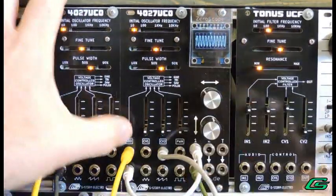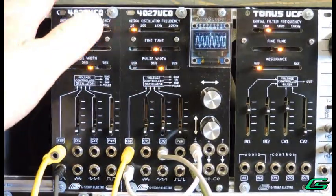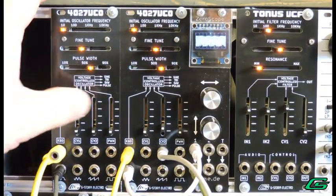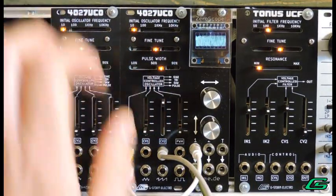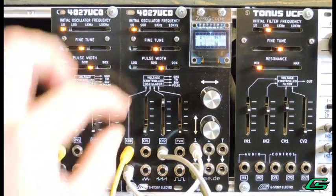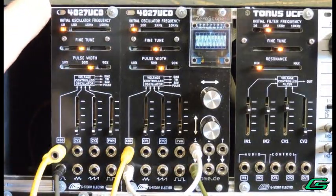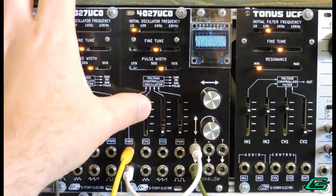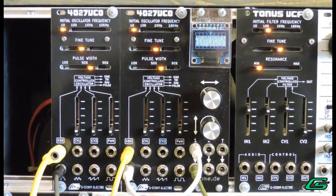CV2 is a reduced range modulation that can help you find the sweet spot for vibrato. But it still has ample range at the top end if you want to get crazy. CV1 and CV2 do interact with the frequency path, even when nothing is plugged into them. These inputs are not buffered, and nothing is normal to these jacks, like on the 2600.